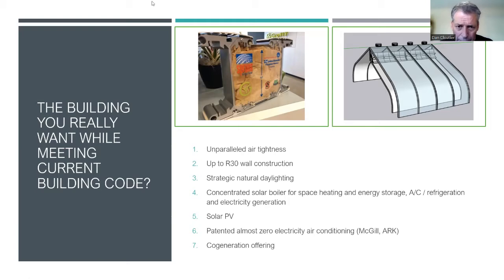And so what you have is your exterior wall and your interior wall. And you can see how the membrane fits in literally a rope chase on each side into the aluminum beam. And so this membrane will go in that rope chase on each side here, and it'll be one membrane from one end to the other end. And then it will be tensioned, and it never needs to be retensioned. So that's how that's constructed.